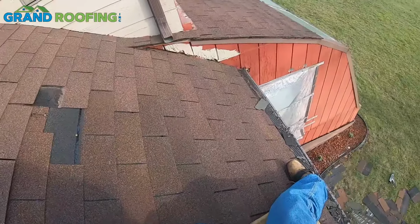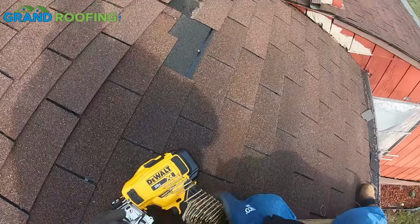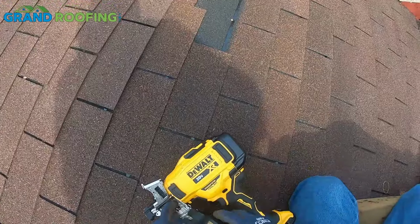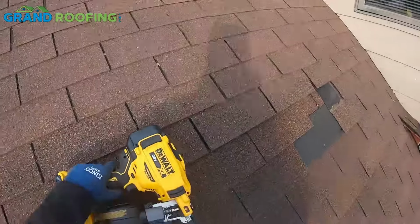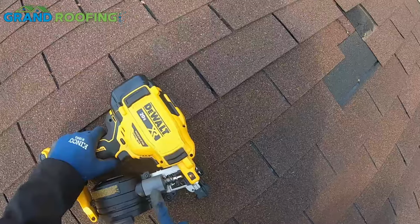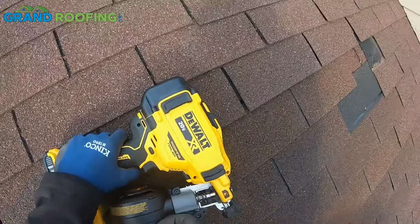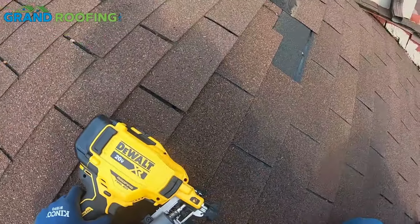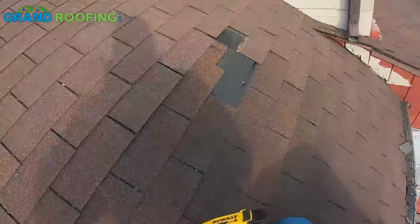So I will be doing a dedicated video about this, as I spoke about on that repair video up there, but I want to actually have it in a little controlled environment, and I want to shoot with a higher frame rate camera. So the GoPro only goes to 240 frames per second, I believe, which might give me more of a slow motion of this. So this one here, I do believe there's an actual coil in here, copper coil windings that actually pulls back and then refires. It's overcoming the spring to contract, and then it releases and the spring pushes the feeder in. So I want to be able to show that.